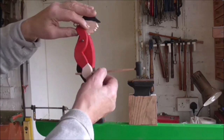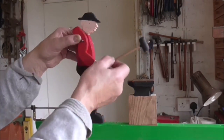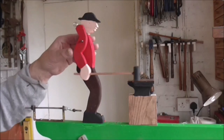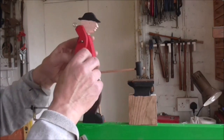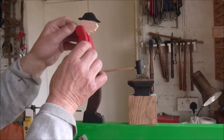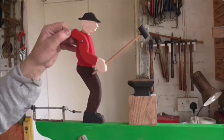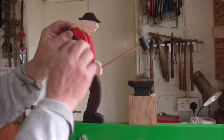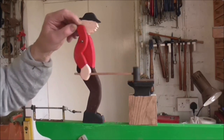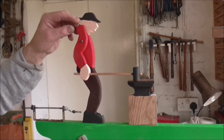At this stage, make a longer handle — you can cut it off later to size and move it in and out to adjust. This is only temporary for trial and error. You want the hammer in about the right position — not too far out, as near to the middle as you can get. That's the motion effectively. Now you've got to decide whether you want the hammer to clout the anvil. Don't worry about it wobbling — that's because I haven't got any washers or fixings on here yet. When it's fitted properly it'll be okay.